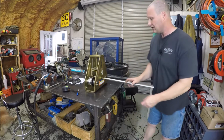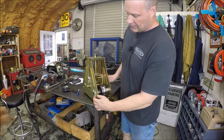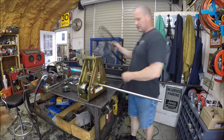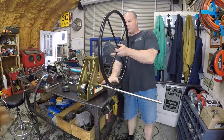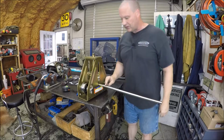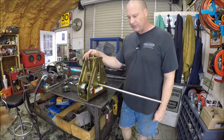Looks pretty simple. So all we need to do really, I guess, to match this stuff is we'll just have to drill a hole. I'll have to get a pin and a washer, and it'll hold it on that side, and figure out about how far I want. I was kind of looking at the pictures, and you have a little bit of a spacing, about 6 inches or so probably off. And what they do is they've got 2 screws here, so I'm assuming that this would have 2 flats. I'd rather have a key in it, but I think for this application the flats will be fine.